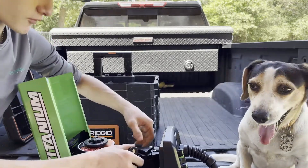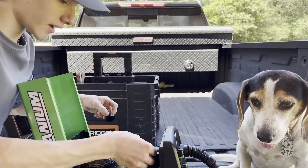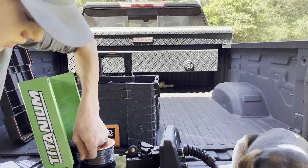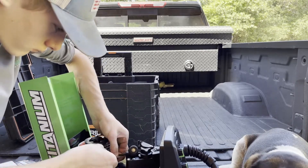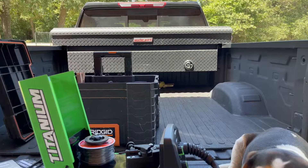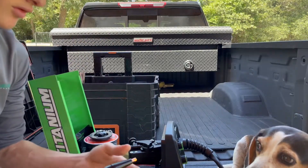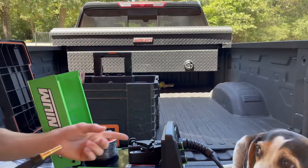Now that we have our wire we can open this up right here, swing that out. We're also going to check that this little tensioner is set on 035 — and it is. We take our wire, cut off the small bend, and feed it through. You've got to release the drive clutch. This welder also has a cold wire feed button where you don't have to pull the gun trigger — you can just flip it and it'll feed wire. But first, we take off our nozzle and then take off our contact tip.